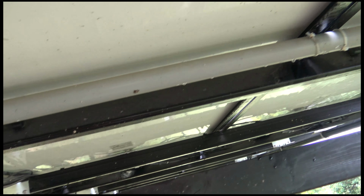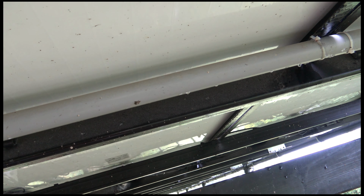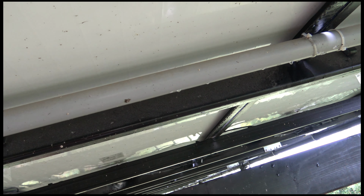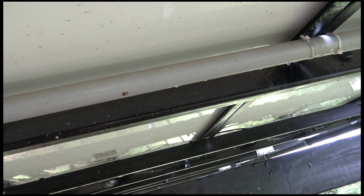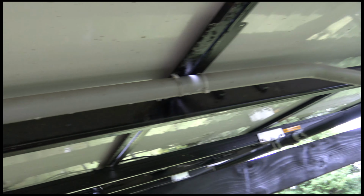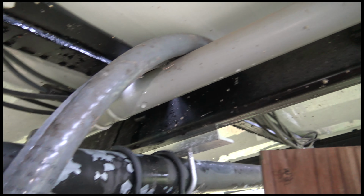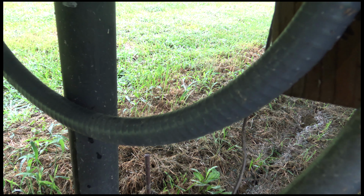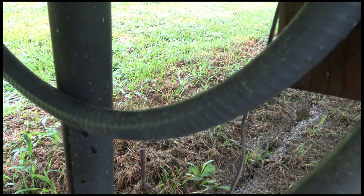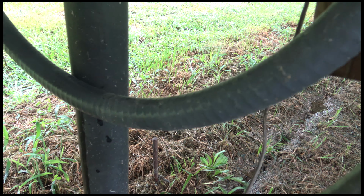Now, if you were paying attention, you might remember that I said that I was using direct burial 2-gauge aluminum to conduct the power back to the structure. There's 4 conductors. It's actually 2-gauge, 2-gauge, 2-gauge, and 4-gauge. And those are coming in through this 1¼ inch rigid PVC conduit. So it would be curious if I could get those direct burial cables to fit inside this 3/4 inch flexible conduit, because those cables are way too thick to fit inside a 3/4 inch flexible conduit.